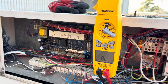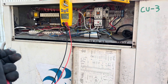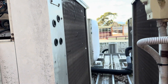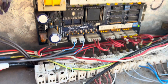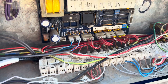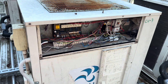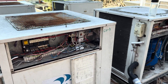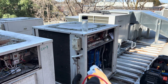Turning power back on and confirming voltage out of the board again. With the thermistor removed and testing voltage coming out of the board — five volts. That's interesting. I'd chalk it up to a one-off except this unit keeps failing, so we're going to keep digging. In the meantime, I've got my probes so we'll probe up and see what our pressures are doing.